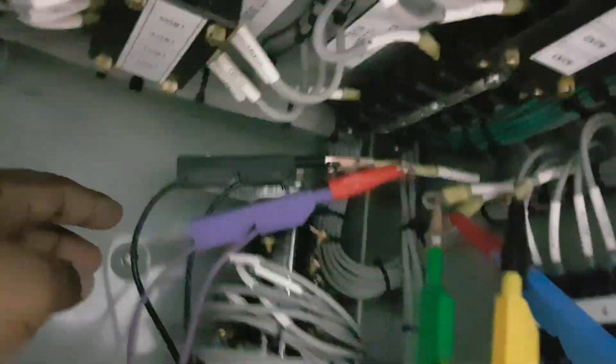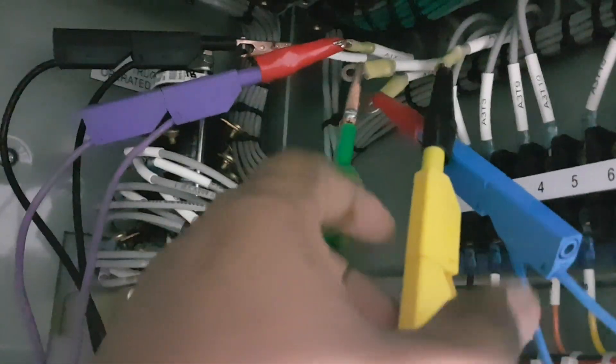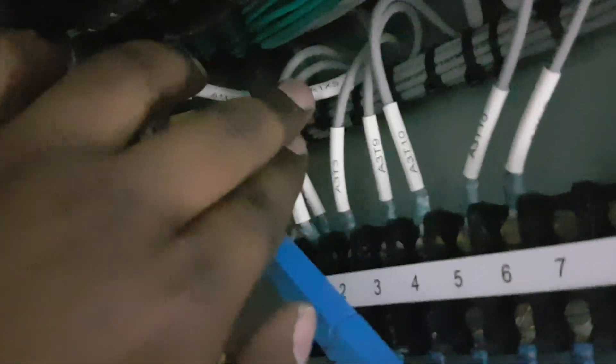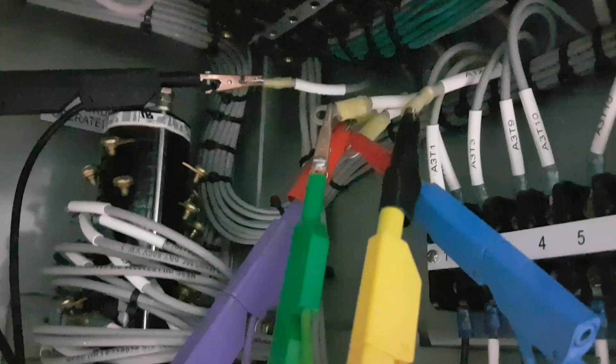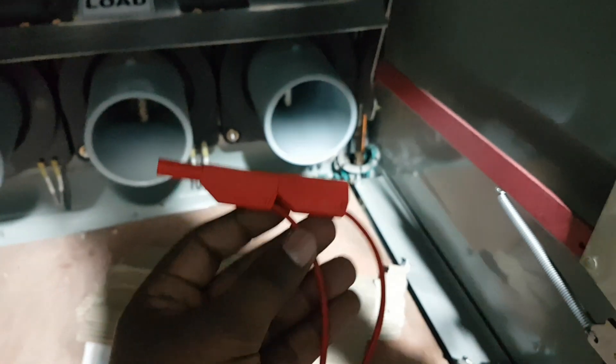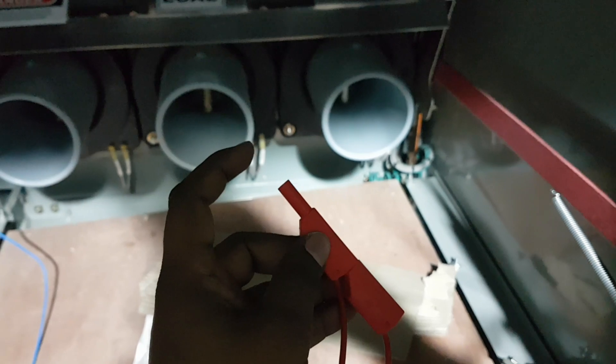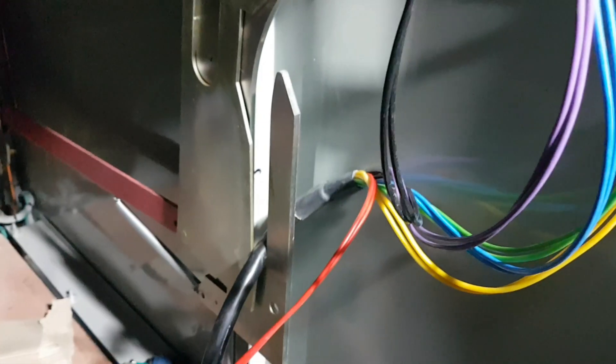CT H1 is here, CT back side will be H2, and this is CT secondaries. The CT secondary cables from the CT will come to this terminal block. In this terminal block we have to connect our CT analyzer secondary cables. See here - this is X1, X2, X3, X4, and X5. The ferrule is mentioned accordingly. The sixth core is left open because our CT is only five cores. The output cable will come, we have to jumper it, and connect one clip to CT secondary like this.